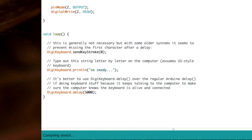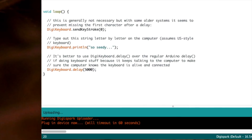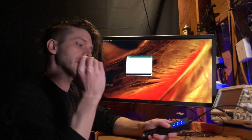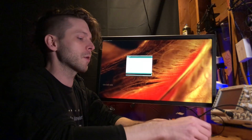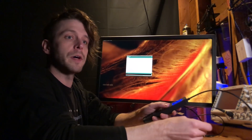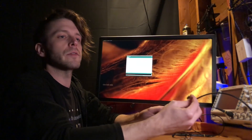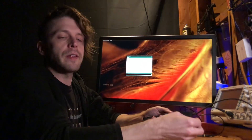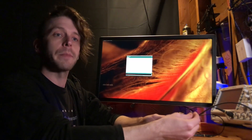This is going to compile, then ask you to plug in the device, giving you 60 seconds to do so. Within five seconds of plugging it in, it will be looking for the programming request. I recommend using a cheap USB hub because you don't know the state of your soldering job yet — this will help protect your computer against any bad things that may have happened.